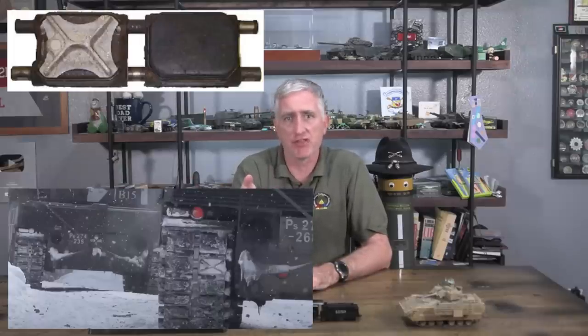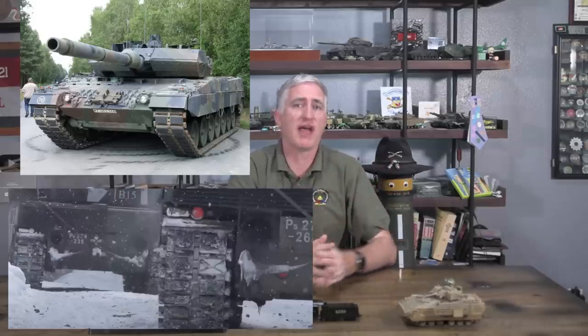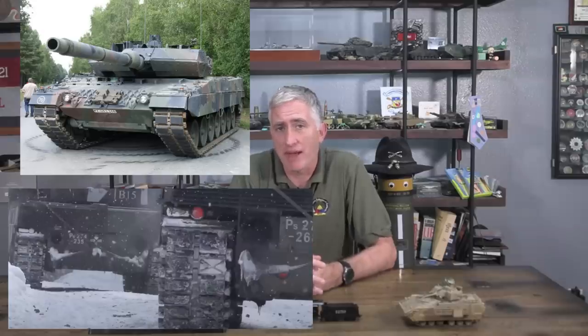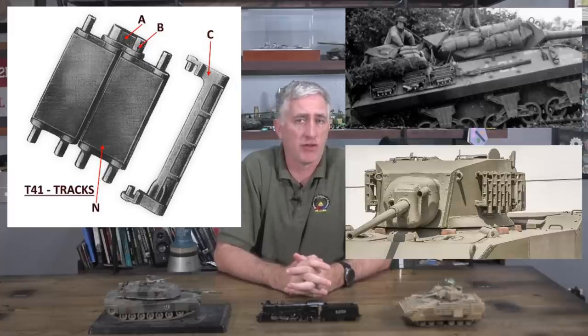Which brings us to the original question of additional grip. On a modern tank, if you need more grip due to snow or the like, there are grouser pads available. What you do is knock out the rubber pads every tenth link or so and replace them with metal grip pads. These are most obviously seen carried on German vehicles — those X shapes carried in rows — where each X replaces a rubber track pad. In effect they perform as snow chains. You can't simply remove the track pad and not replace it with anything at all, as you don't get quite as much grip as you would from the X. In World War II, traction grousers were basically long metal bars which would be attached across the extant track, and these would often be seen on the backs of M10s or on the sides of Stuarts, for example. If you have neither available, it is not unheard of to reverse the occasional center guide so that the teeth on the center guide stick outwards, but you do want to be careful doing that if you are likely to be driving on metal roads.